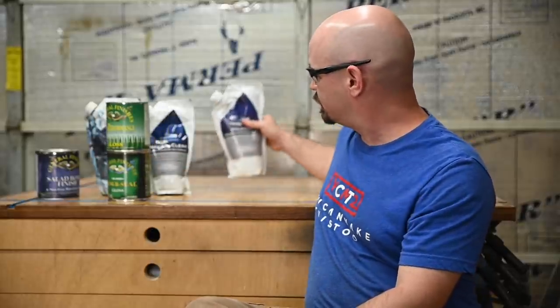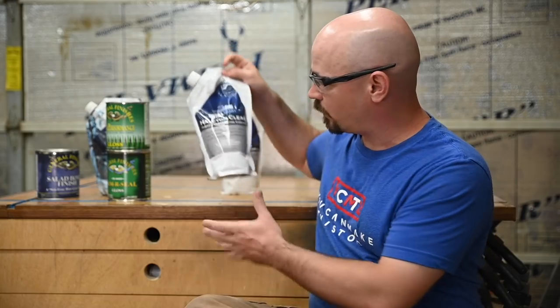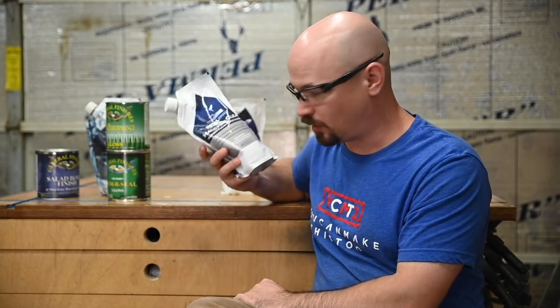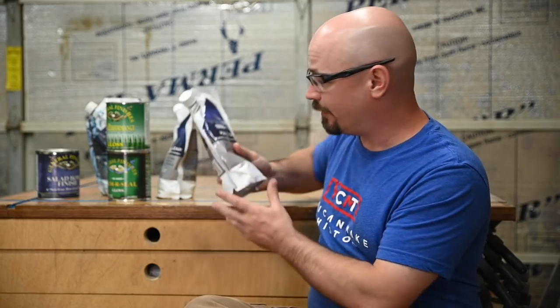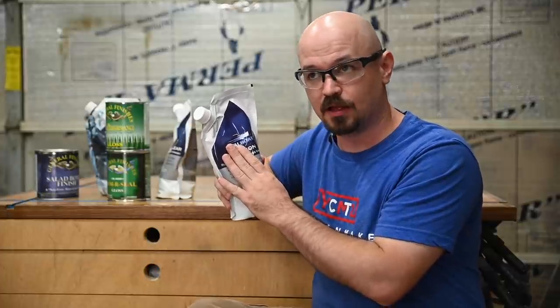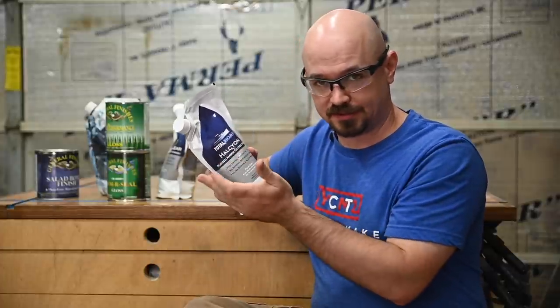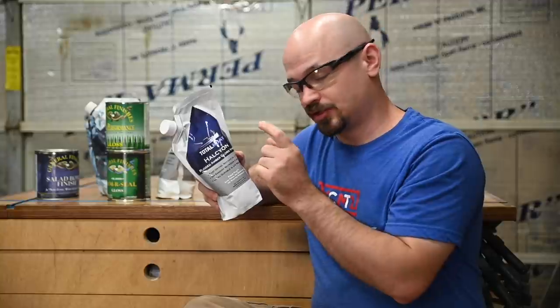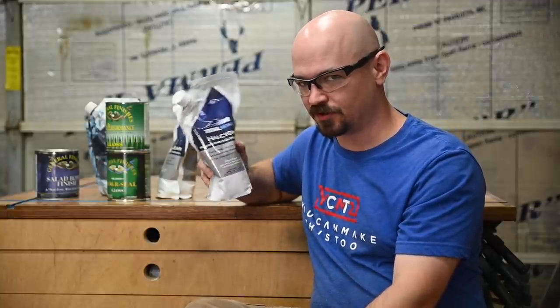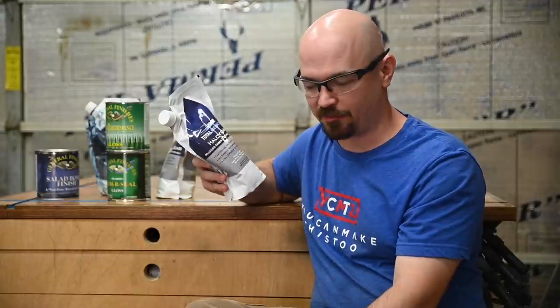So the same can probably be said for this, which I like to use, Halcyon Clear, which is a varnished polyurethane. However, it's rugged amber because this is water-based and not oil-based. The color isn't coming from linseed or flaxseed oil or something. This is actually pigmented to get that amber. So pigments aren't covered in that list. They may or may not be food safe.